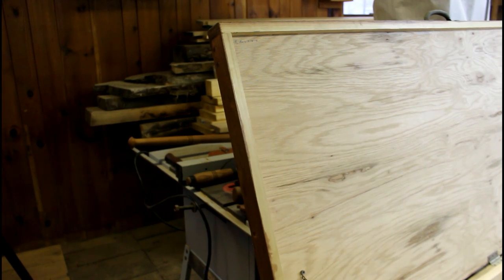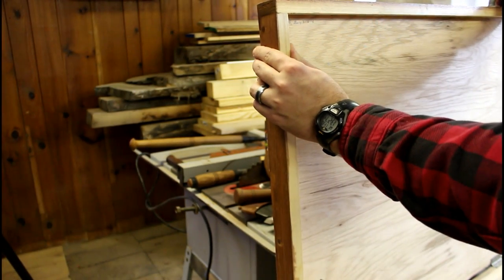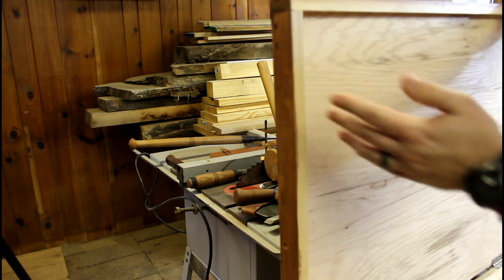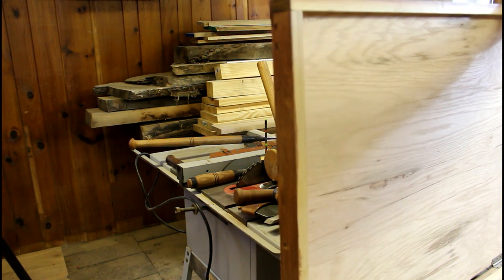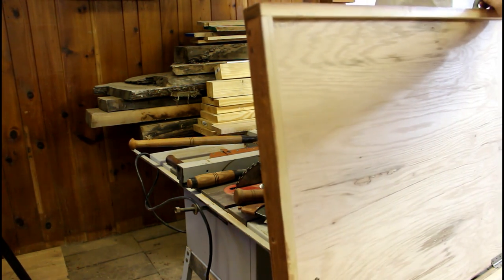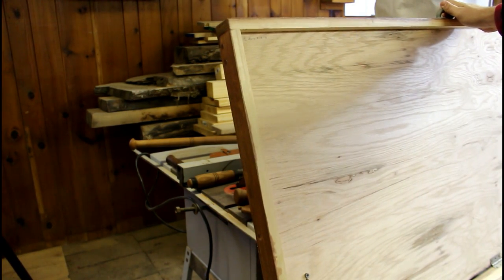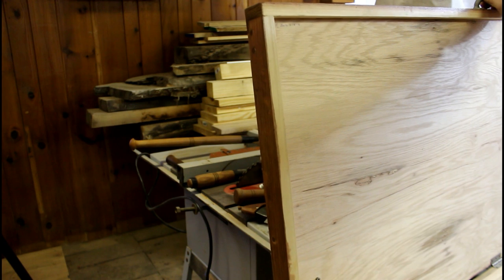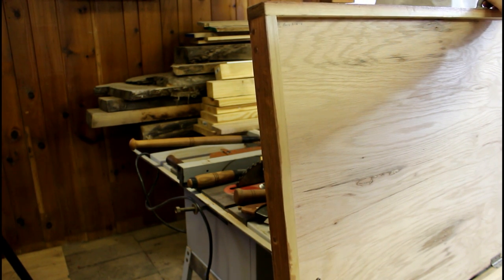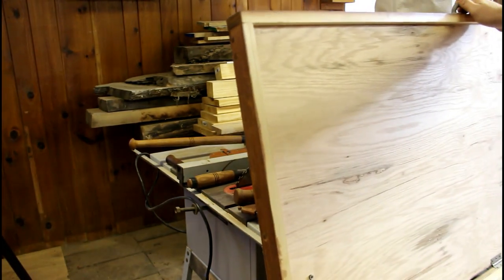In my opinion the key design on this chest is the dust cover that comes down over the lid. When this toolbox closes you can feel that suction - you know it's a good fit and it really keeps the dust out. I have some other things in here to keep rust off tools, but this is the main thing. Anything with dust is going to have salt on it, and when you get salt and dust that's when you start getting rust. These old metal hand planes will rust up in a hurry if you're not careful.